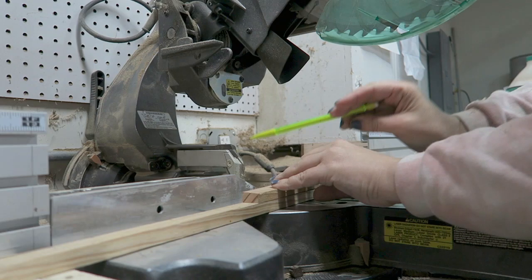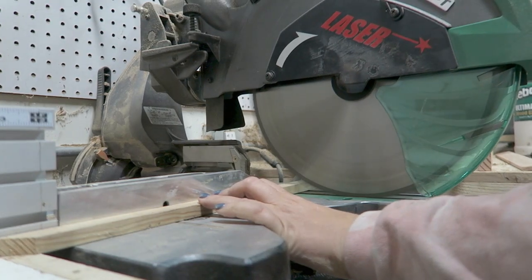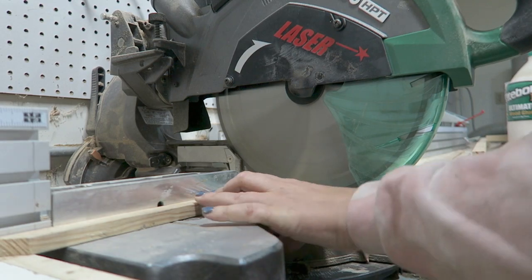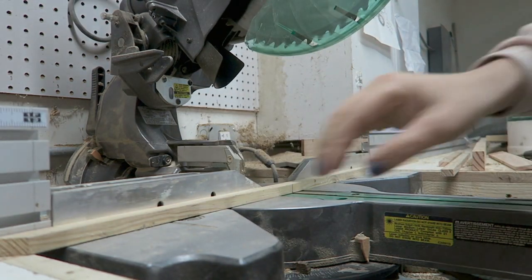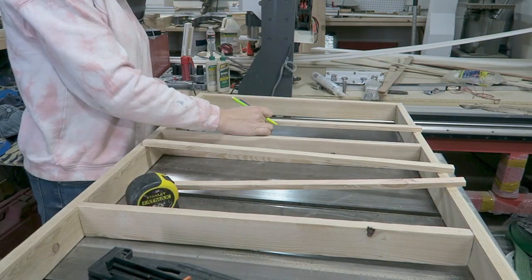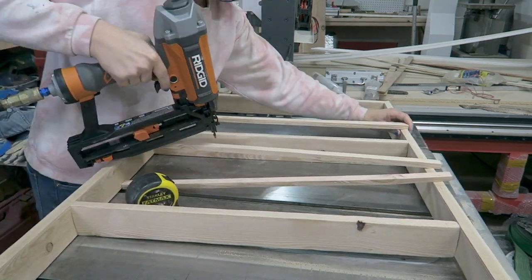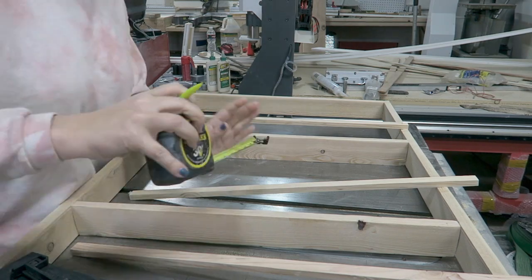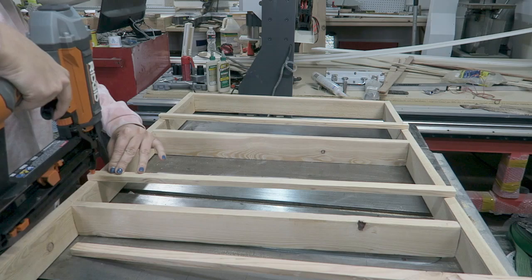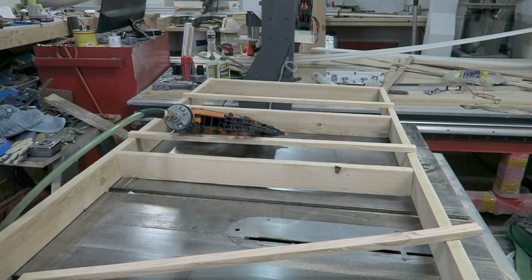This is a thin little piece of wood — honestly it's scrap wood. You could also just use a square dowel. I measured and cut this down to length because at the end of the project, when we put the shelves in, just above the shelves on the outer edge, there are some pieces of wood that help to hold everything on the shelf. They're approximately about three inches above the shelf, and then I just stapled those in place, and you can see that this will help hold anything we put in this little wall frame.